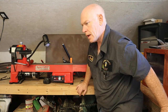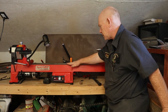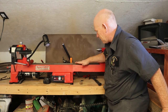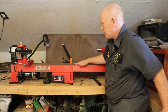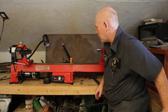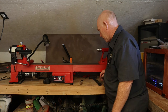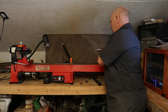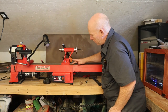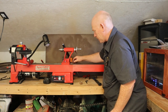If we were trying to machine up some rocket parts or something, the slight difference would matter. The weird variation is it seems to dip more into the center. And then there might also be some discrepancies with the straight edge I use, because it's an extraordinarily old beat up framing square. But with the ability to have this just slide across relatively smooth, and you can feel a rise right here, they're not 100% perfectly aligned.